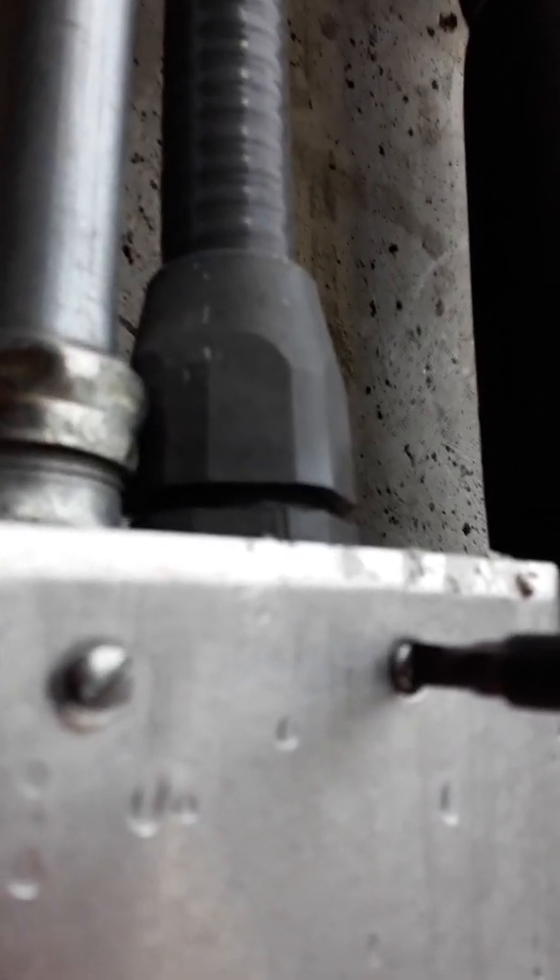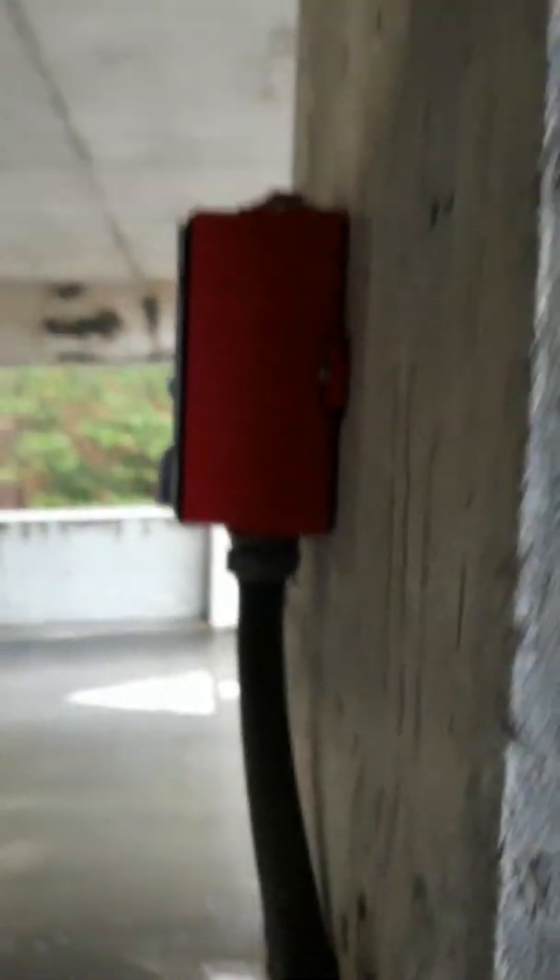You need stainless steel screws on the outdoor boxes. Look at that water coming out of that hole — see it's coming out of the bottom already. That's going to be a bigger job. They need to make a thing called a weep, and they should have stuck that on the bottom of this box. Should have been one over here on that too.